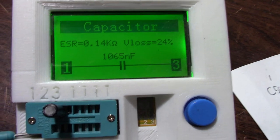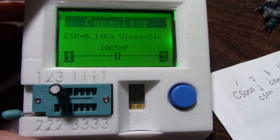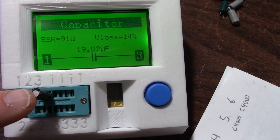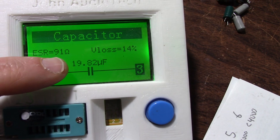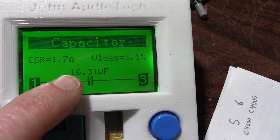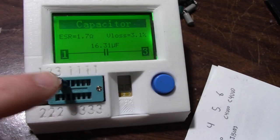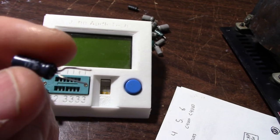Here's another example: supposed to be 22 microfarads, reading 1 microfarad at 140 ohms — pretty bad all around. Here's a good example of why you have to test for ESR: this one is 22 microfarads reading around 20, so you might say good enough, but the ESR is 91 ohms — a lot high. And here's one from my new stock — supposed to be 22, measuring low ESR. It's probably a few years old but the ESR is fine. I check all replacement capacitors to make sure they're in good shape before installing.